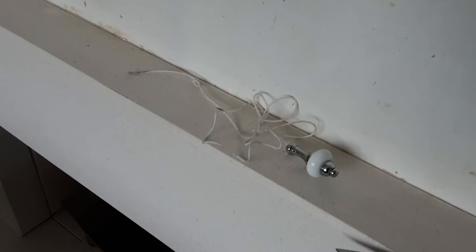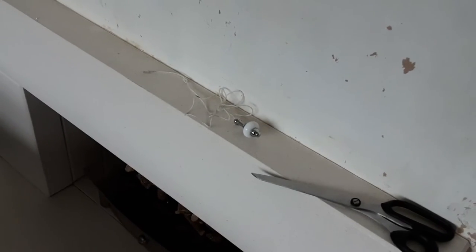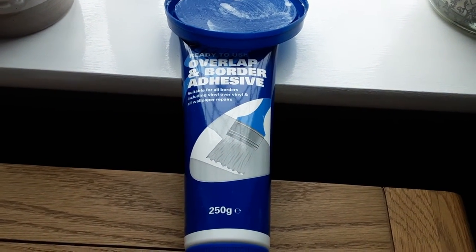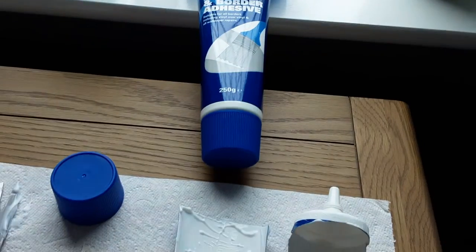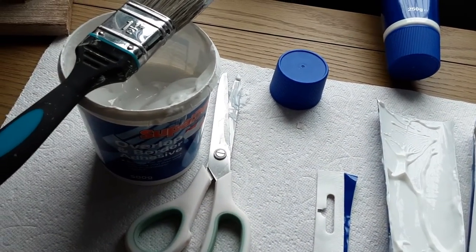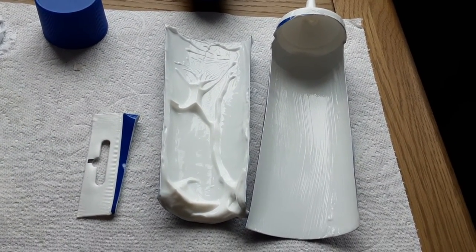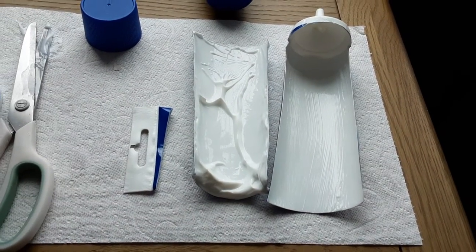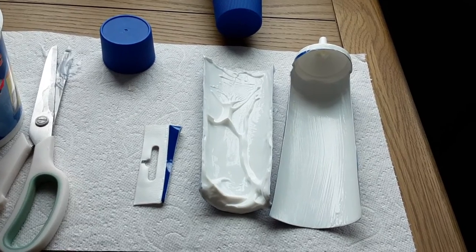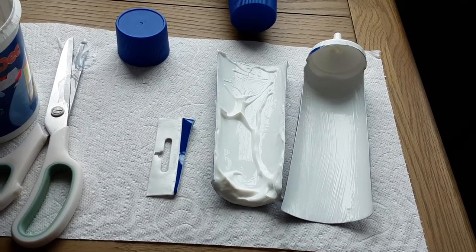You don't have to buy anything expensive — that's the pull cord out of the bathroom, an old one obviously. As a bit of a tip, we use the overlap border adhesive. It's mainly for putting border on, but we use it for all the joints. When you buy it in tubes you can never get it all out, so we cut the tubes open — and that includes all items that we buy. We always make sure we get every last bit out, because manufacturers always make sure there's some left in so you don't get your money's worth.